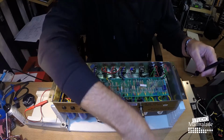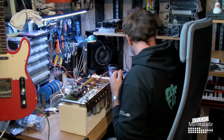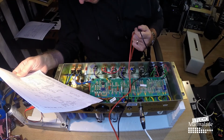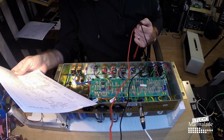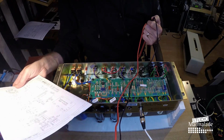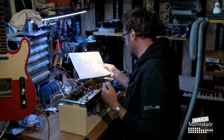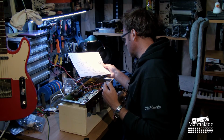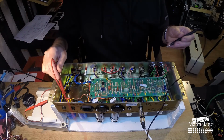After doing that, I could then conclude that the output transformer could be measured between the capacitor over here, the 2 × 50 microfarad, I think. 50 plus 50 microfarad, 500 volt capacitor, which is one of the filter capacitors, before the choke. From the two halves of that capacitor, so it acts as one 100 microfarad capacitor, goes wire to the center tap of the transformer. So I can measure from there to the respective plate connectors on the tube sockets, which is pin number 3.